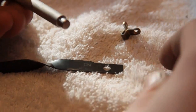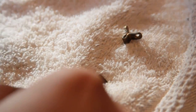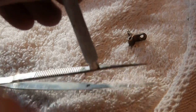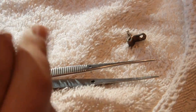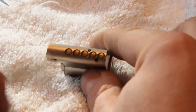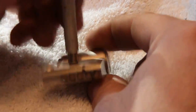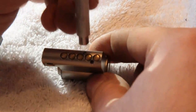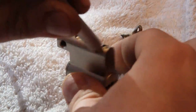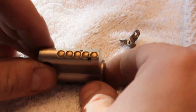And then it has on the other end a rare earth magnet which is pretty strong. It's good for picking up parts that you may have dropped, but it's also great for testing your various things laying around, or parts of your lock, to see if they're made out of steel. For example, on this Multilock which we looked at last week, I was talking about hardened steel pins. The body of the lock is not ferrous — probably brass or something — but if I hold the magnet up to that pin, you can see that it sticks. So that's a steel pin. When I'm taking things apart I sometimes like to see what they made out of steel and what they didn't.